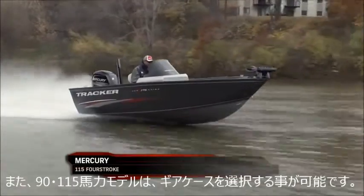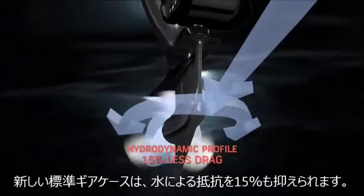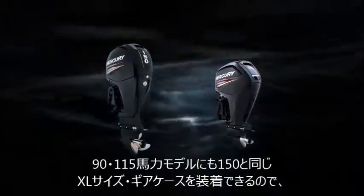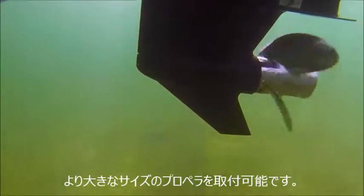We've learned a long time ago that you just can't take a one-size-fits-all approach to gear case design. So for the first time in a 90/115 range of product, you've got a couple of gear case options. We have a new standard gear case, which is an all-new profile — basically 15% less hydrodynamic drag, which means it moves through the water easier. But then for boats that are a little bit bigger, heavier, and need a little more lift and help getting out of their own way, we've got a command thrust gear case, which takes the larger gear case off the 150 with a different ratio and puts it on a 90 or a 115. So you've got a lot more leverage in the water and the ability to swing a big diameter, big blade area V6 class prop.